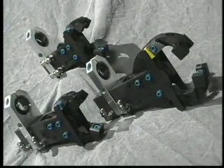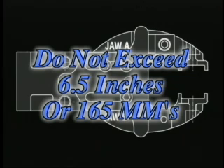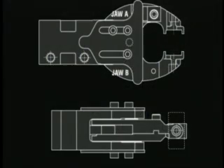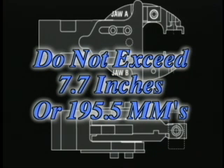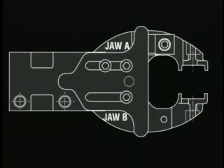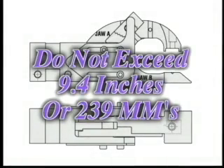The Design 2 GRM clamp is now available in three standard sizes and operates at pressure ranges from 30 to 100 psi. The Design 2 size 2 GRM offers body and jaw styles which do not exceed 6.5 inches or 165 millimeters in length for standard jaw styles, or 6.4 inches or 162.5 millimeters for flange jaw style clamps. The Design 2 size 3 GRM offers body and jaw styles not exceeding 7.7 inches or 195.5 millimeters in length for standard jaw styles, or 7.6 inches or 193 millimeters for flange jaw style clamps. The Design 2 size 4 series GRM offers a larger envelope size yet, 8.8 inches or 223.5 millimeters for standard jaw styles, and 9.4 inches or 239 millimeters for shovel jaw style clamps.